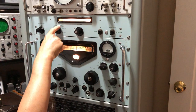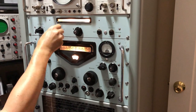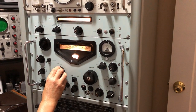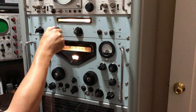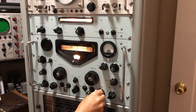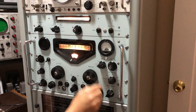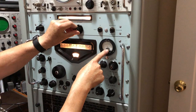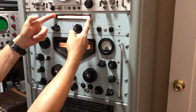To tune to 820 kilohertz — the same station we were listening to on the RA17 — we tune on the red kilohertz dial and it goes backwards, so we go backwards until we get to 820. We use the preselector in the LF unit. On wideband you can hear the station, the same as before. We tune in on the red dial and switch the preselector to the 500 to 980 kilohertz range, then tune for a peak on the meter at 820 on this preselector scale.